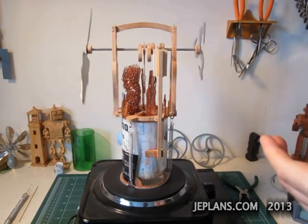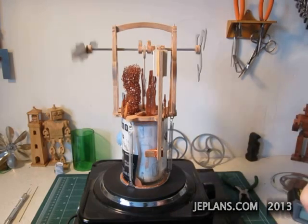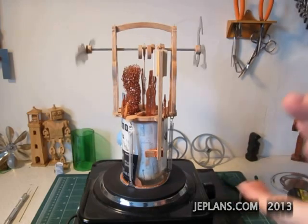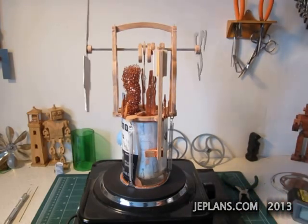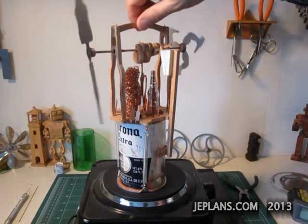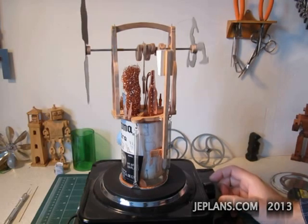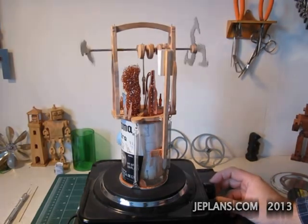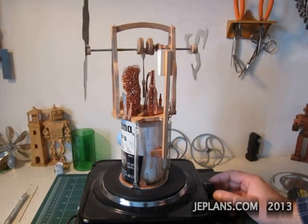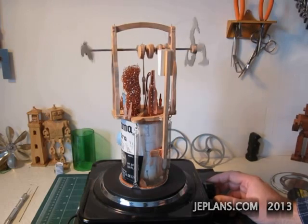On the upper side, the wood stove rarely gets over 650 degrees — that's a little on the hot side, typically it stays under 500. The Phoenix engine and my older beer bottle engine that use a piston instead of a bellow operate pretty reliably around 150 degrees surface temperature. So we'll just take this up to something closer to 650–700 degrees and see how it runs at that temp.